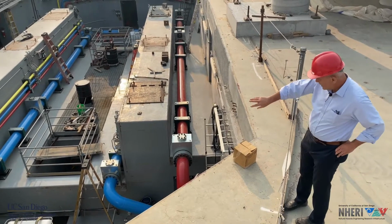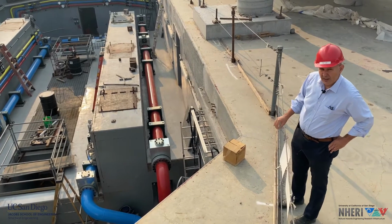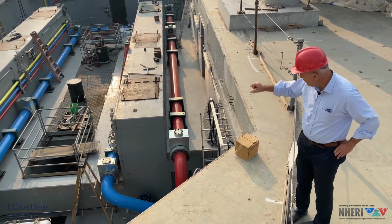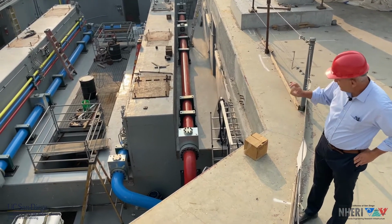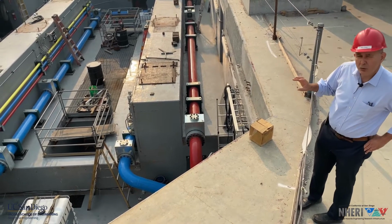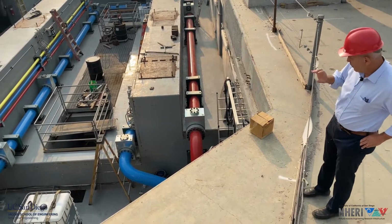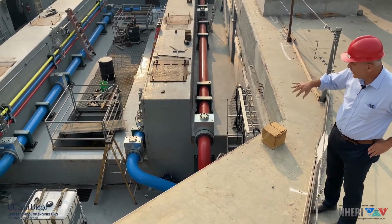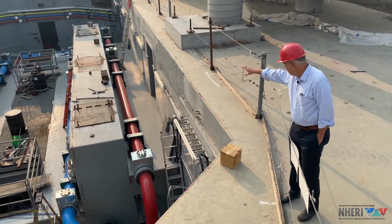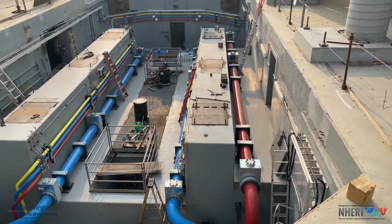You see, these are gigantic pipes. They have a 12-inch inside diameter. They are 1¼ inch thick. You also see a lot of smaller pipes, red, blue, and yellow. These are the pilot lines: the red is pilot pressure, the blue is pilot return, and the yellow ones are the drain pipes.